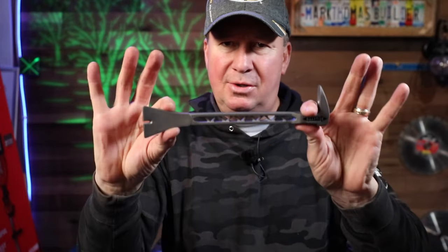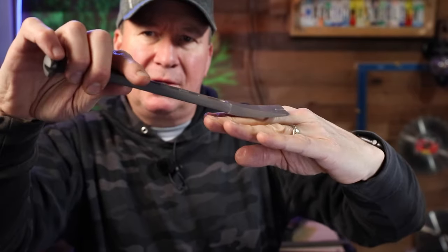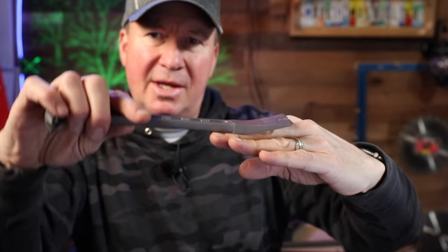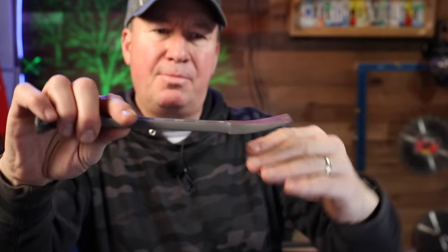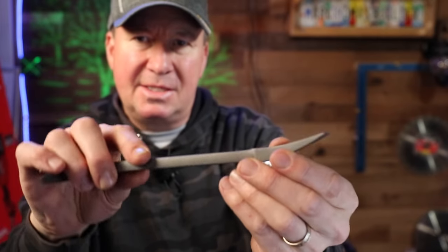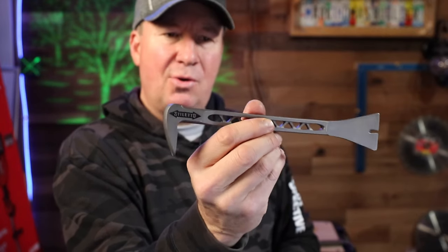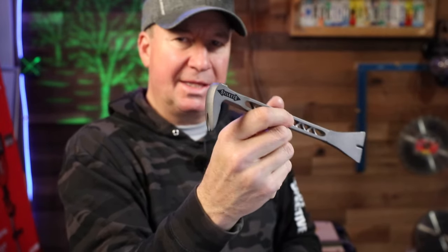This is just a nice universal tool. If I'm doing trim work, I'd like to have this on my tool belt as well. I like that gradual curve — so if you're trying to set some windows and need to raise or square something up, you can get this thin bar into some tight spaces just to lift a little bit. It's pretty thin, really a great tool, and if I lost this I'd go out and get another one right away.